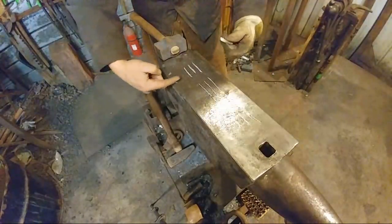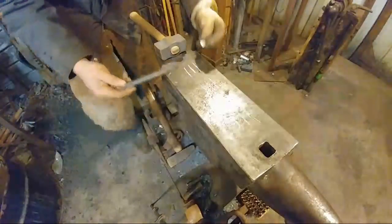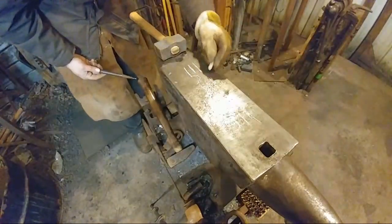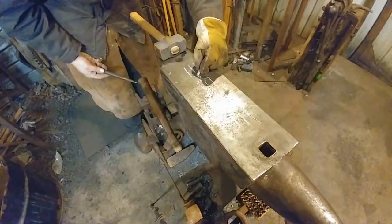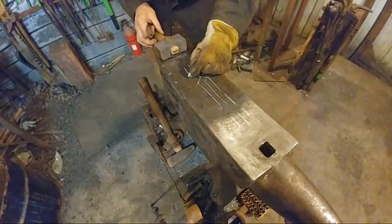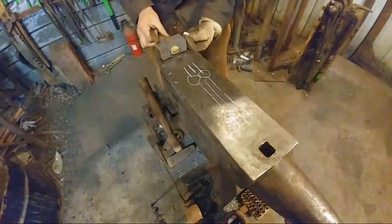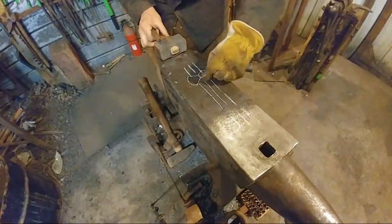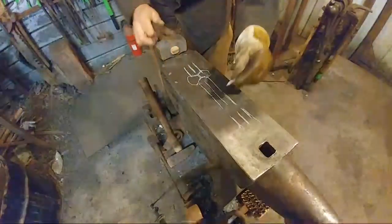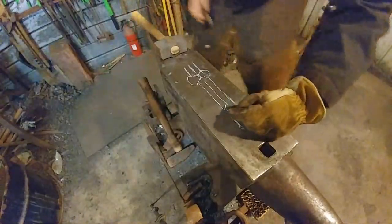Yep. Okay, so your punch has a bevel, has an angle to it. So if you put those bevels to where they're on the outside of the hole, you end up with two halves that look like this. This is a cutaway, okay? So when you swell a rivet over in here, it looks like that, a dog bone shape. A very stable rivet hole, okay? And that will hold the two halves together very well. If you get this incorrect, you'll have something that will look...